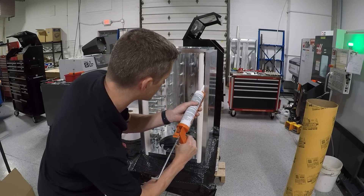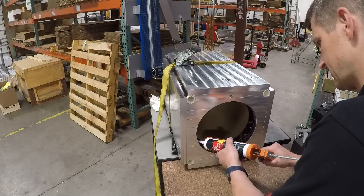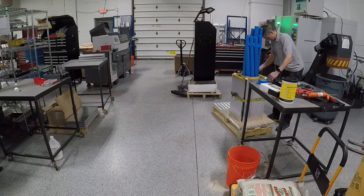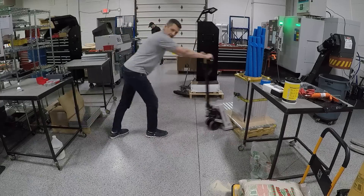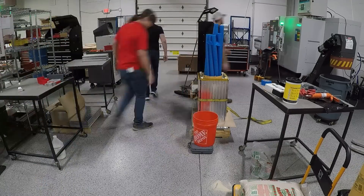We were already set up to make large quantities of flat plates with our fixture plate line, so making the four sides, top, and bottom was really no additional work, and we had most of that material already on hand. We used some RTV silicone around the PVC and the concrete form — this really only matters for the actual pour to minimize epoxy seeping out through any cracks. We'd heard that Keith Rucker had a pretty catastrophic fail with a similar project using a concrete form with true concrete, so we stuffed our form with pool noodles to give it internal support. I tried Great Stuff expanding insulation foam — terrible idea. In the end, we wouldn't have needed any of it; the epoxy wasn't as wet or as heavy as concrete. But at a dollar per pool noodle, it's pretty inexpensive insurance.